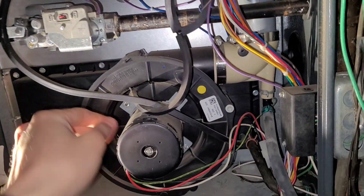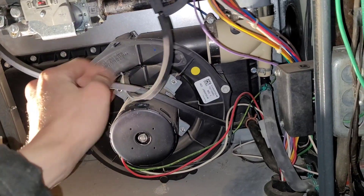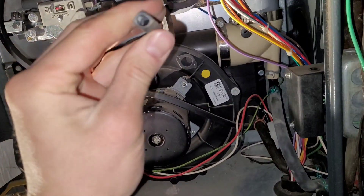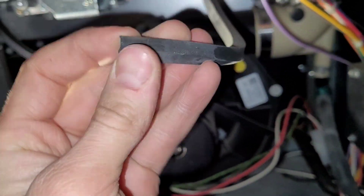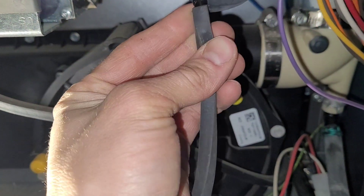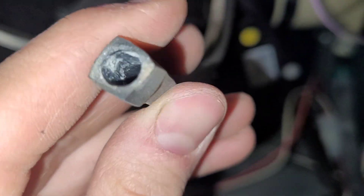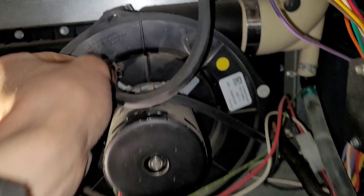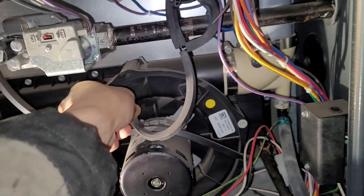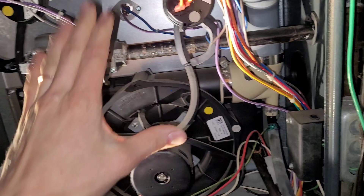When I looked at it before, I actually thought we had a plugged piece of tubing. You have to inspect your tubing all the way along — if it's cracked, loose, or has any kind of restriction, including in the nipple that goes through into the combustion blower, you can end up with the pressure switch not reliably opening and closing.